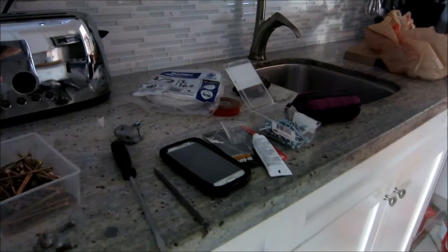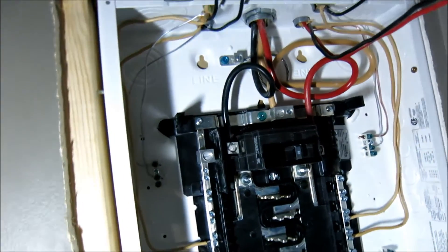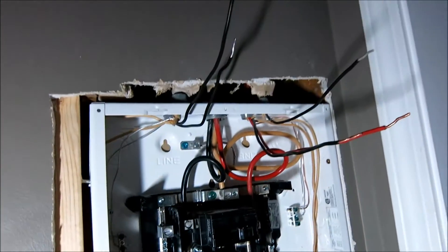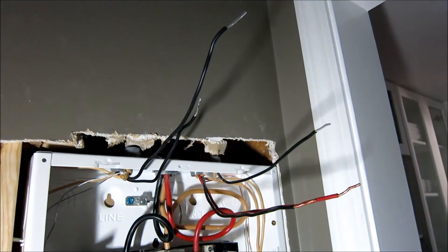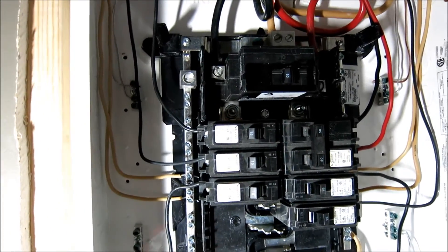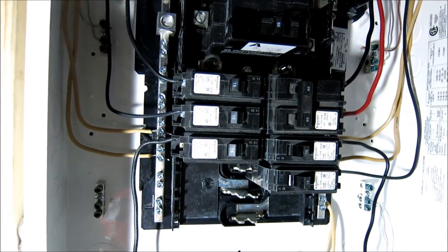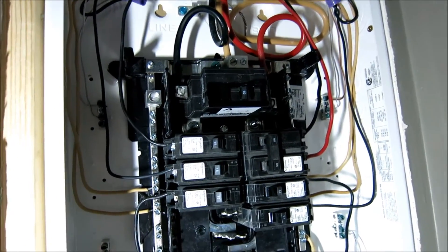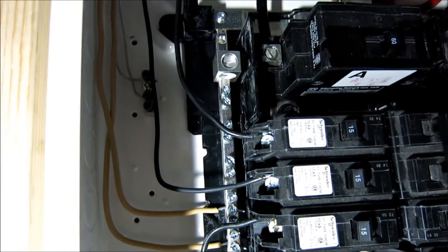See that little white tube? That's penetrox. You're definitely going to want to use that if you have aluminum wiring. If you have copper, you're solid. I do have aluminum wiring so we were penetroxing everything. Now we're ready for breakers. As you can see breakers are all in. After we get this going, make sure the top piece sits right, and again if you've got aluminum — penetrox.